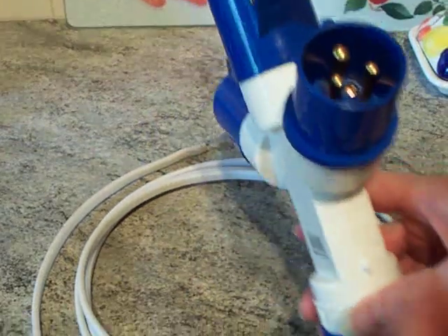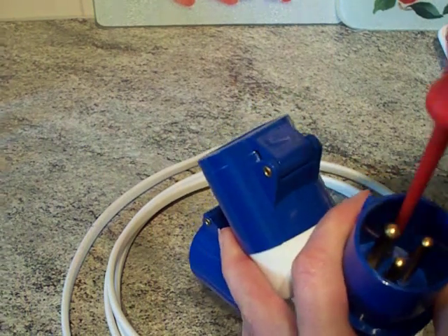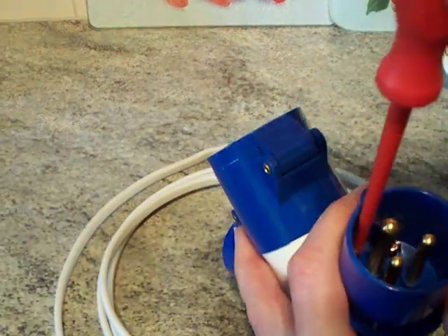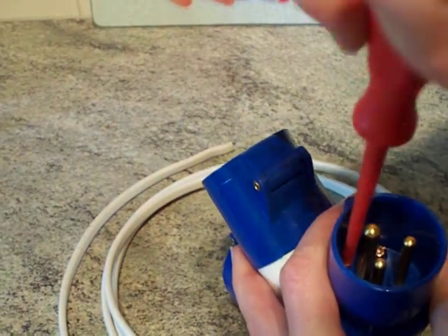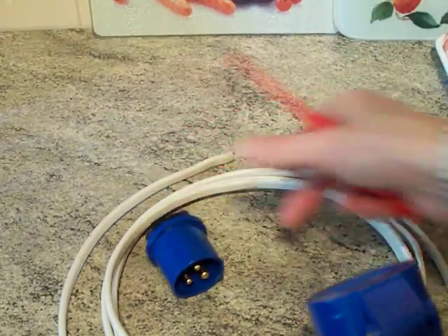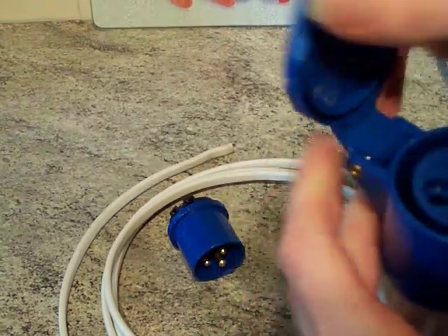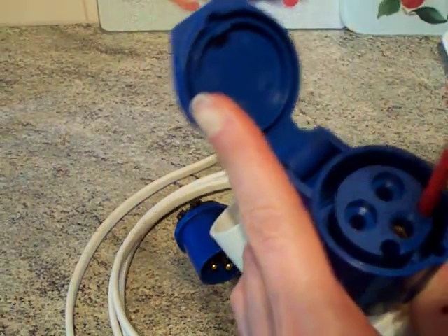What I'm going to do now is take all the accessories off and have a look around inside. There are a couple of screws — we'll just whip that off. I'm taking every accessory off because they've got to come off anyway for wiring up, so I can negotiate and wrangle those cables in there. That cable is actually for burying inside a wall so it's not flexible — getting that wire in there is going to be a bit of a challenge. There's the plug off; now let's get the socket off. You can see there's not much space in there — two screws in that one.